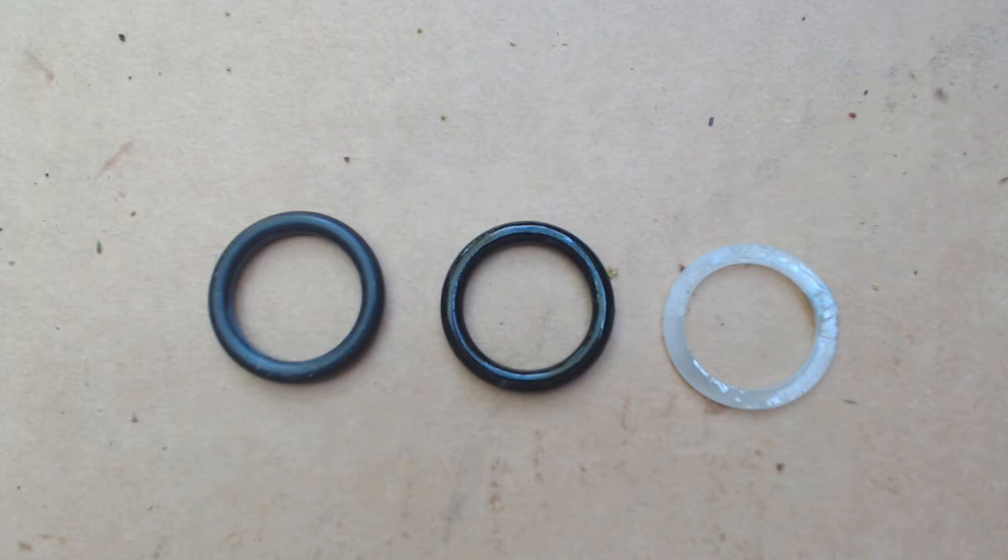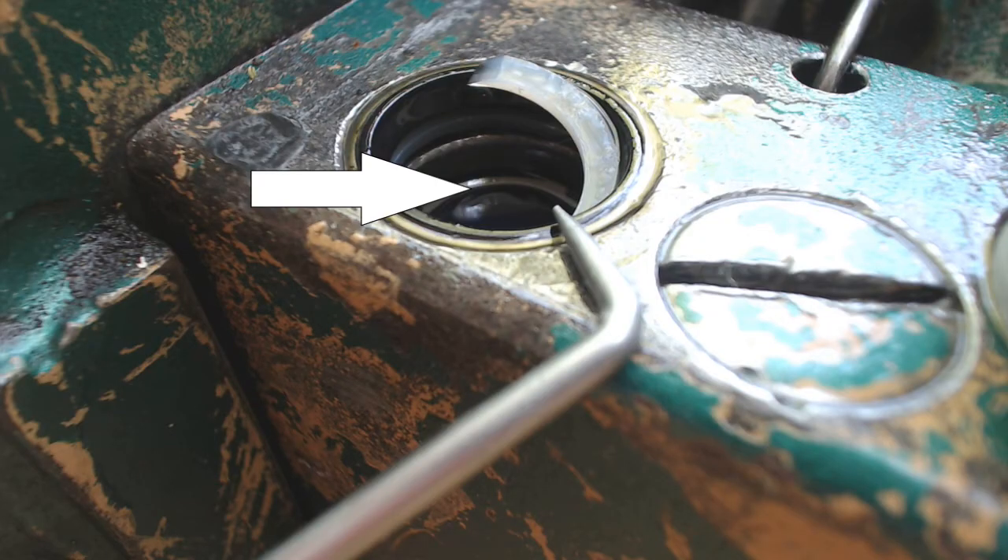What is a backup ring and why do you need it? Basically they're designed to keep and stabilize the o-ring in the bore to make sure the o-ring stays mostly round under high pressure situations. Without the backup ring, you run the risk of the o-ring being distorted to the point where it would cut or damage the o-ring. In our case, the backup ring sits just above the o-ring in the o-ring boss. It definitely should come out first and then go in last.